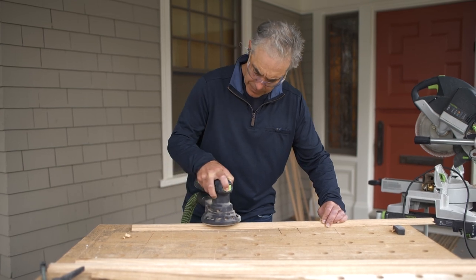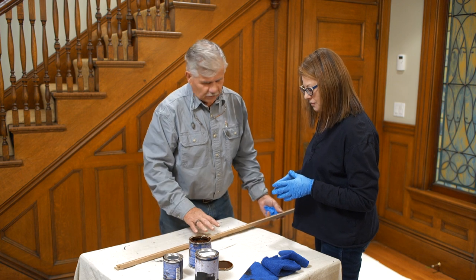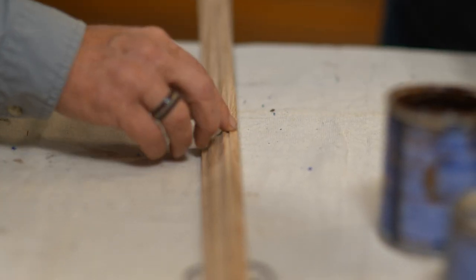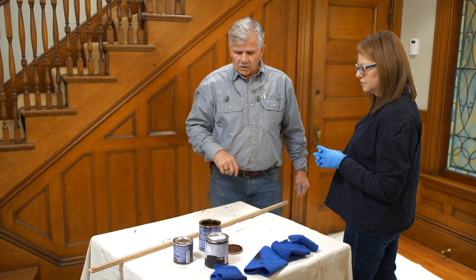See how that changes the profile? So we're going to sand this up. I'm going to use some 180 sandpaper in our sander — that should take it down pretty easy. All right, Maddie, the first one's sanded, ready for you. So what you're going to do is take a rag and wipe it on pretty thick. If you can get it in the cracks somehow with the rag, or use something to push it down there, just wipe it in. Get it nice and thick, give it a little time to settle in, and then wipe it clean. What if it gets all balled up in there? Well, we'll be able to get it out — we'll use a stick or a Q-tip. And it doesn't matter if it stays in there anyways, because if you look at the deep lines, the stain gets in there and you can't wipe it out completely — but it also adds to the little detail. So you get this started and I'll go get some more while I start cutting the pieces.